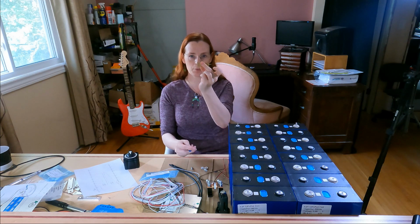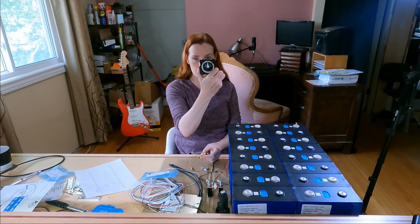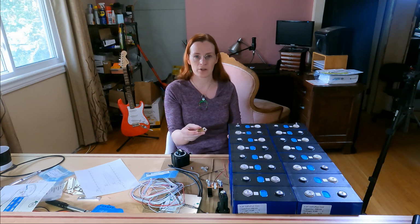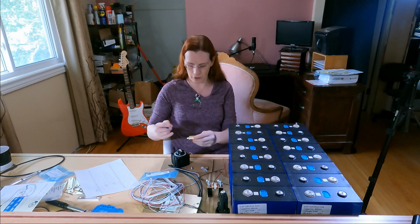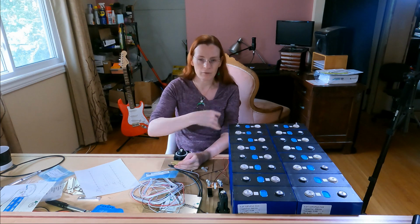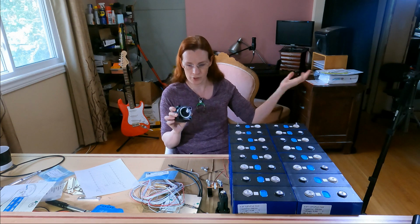What this is, a push button. Probably can't hear that. It's a push button that would create a connection around this switch. But because it's a resistor, it doesn't allow the current to flow super fast. So the idea behind this is when you're about to connect this for the first time to an inverter with big capacitors, you'd press and hold this button for a second, and it allows the current to bypass this switch and pre-charge the capacitors. So you hold this down for a couple of seconds, it charges the capacitors, then you turn the main switch and your battery's on and your inverter is charged.